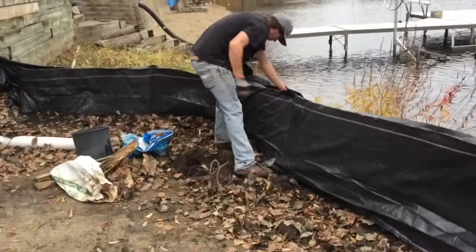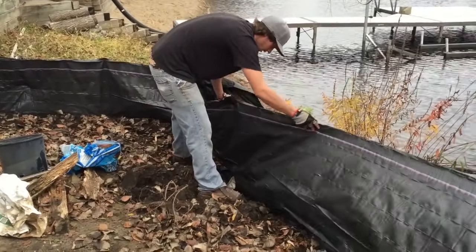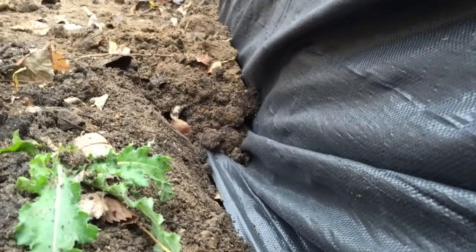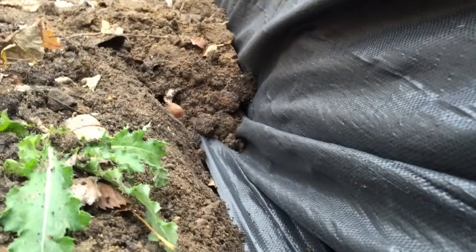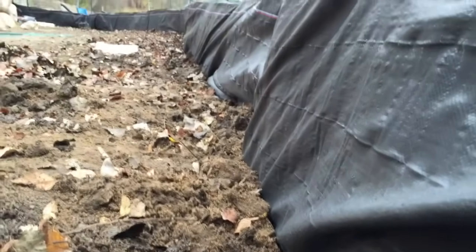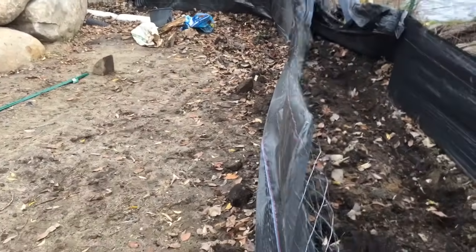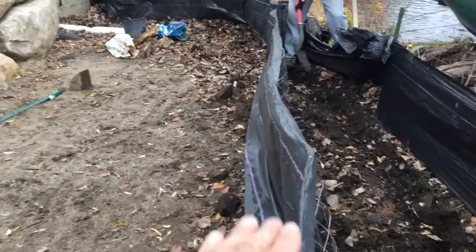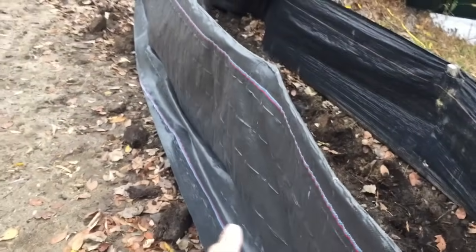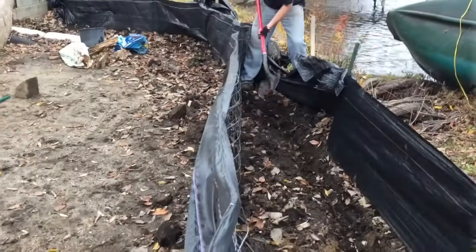What Jake's doing right now is getting the silt fence initially set, putting the bottom extra length in place. This fence actually has a flap dedicated to fold over so you can kick it in and then cover it with soil. Any sediment that comes down will hit the silt fence fabric material on this side and then be stopped or reinforced by the wire mesh on the back side of the fencing.